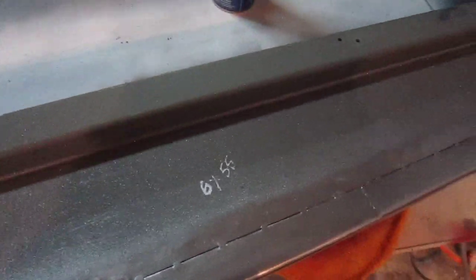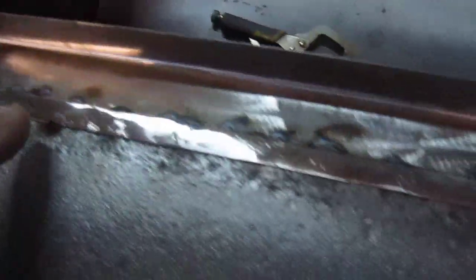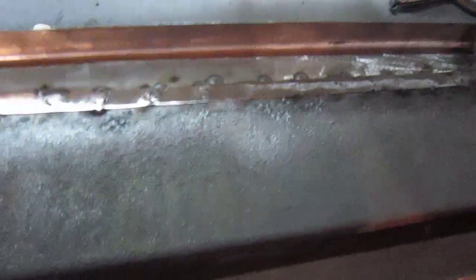I've left the inside — this has got Weld-On primer on it. You can see how it's been done — it's all been welded with an overlap all the way around. So what I'll do now is clean all that up, and then this will all be sandblasted — we'll sandblast the whole thing together, but just to stop it going rusty for a few weeks.